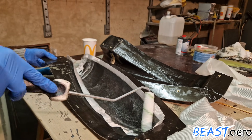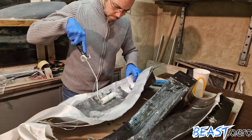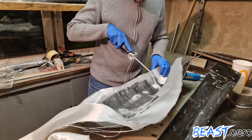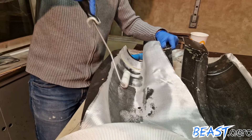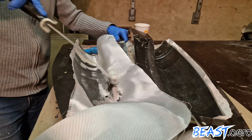The engine inlets will get 4 layers of glass cloth in total, but as this is a mockup only I'm not minding their direction. In the left mold I'm already applying the third layer while on the right side you can see the first two layers finished.